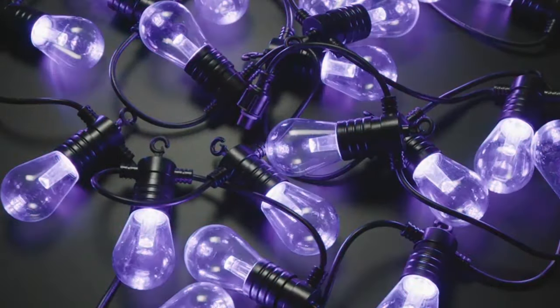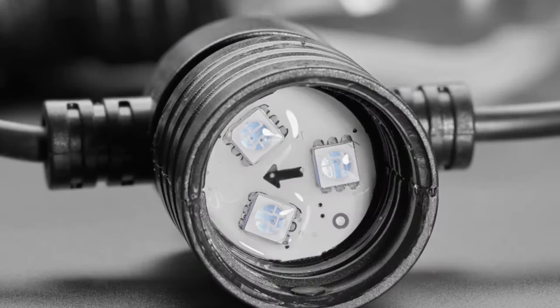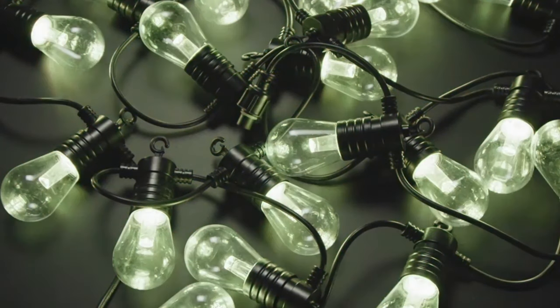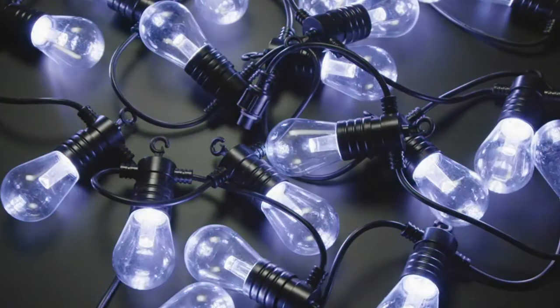Next up, we have another version. This one has RGBW LEDs in it. So if you go here, you'll see the difference between the two. This one has LEDs that have a fourth element that's a warm white LED, and they're still conformal coated. Because they have four channels, not three, and for reasons I don't completely agree with, but I am living with, they don't use the WS2811 NeoPixel protocol. They use the TM1814, which is supported by stuff like WLED, and there are Arduino libraries.